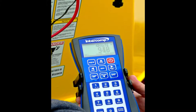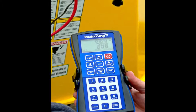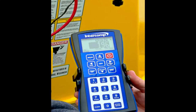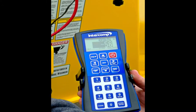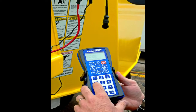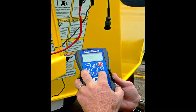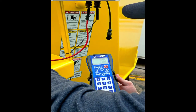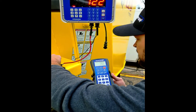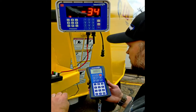So as you're feeding and driving down that bunk, you can see if you're halfway down on that bar graph you would have gotten halfway through that bunk, so you're nicely and evenly distributing your feed. Now as you go to the next pen, you hit onload and you need to feed them 800 pounds. Hit start, and you simply monitor that and close your gate as you approach.